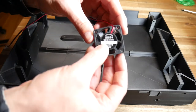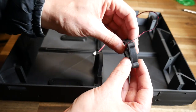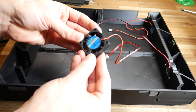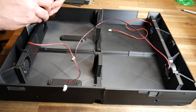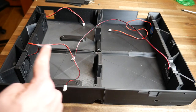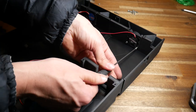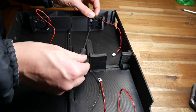Time to introduce our fans. I'm using 4010s, and for all of them the sticker needs to face to the left. There are four slots to insert them — just use cheap 24-volt ones. And remember that on the left-hand side as well, all of the stickers must face to the left. If you get this wrong, you will completely ruin the thermal management of the case, which relies on a cross flow from the right-hand side to the left. At the base of each fan are two holes where you can use M3 by 20 or similar bolts to thread into the plastic case and retain the fan securely.